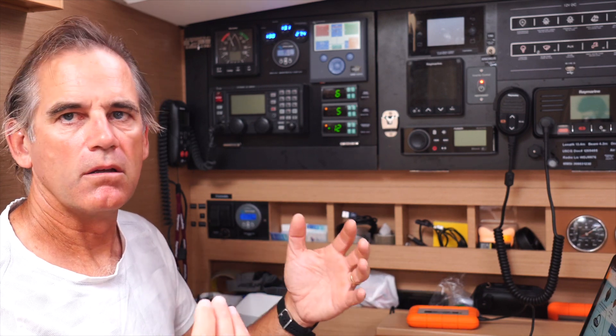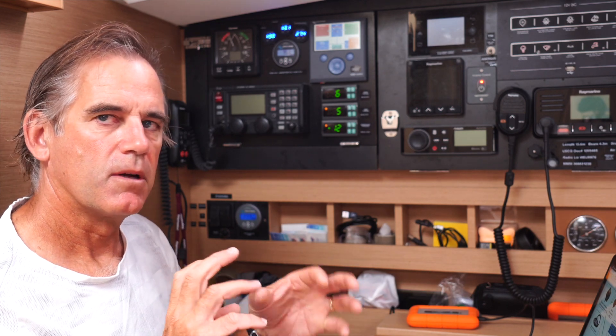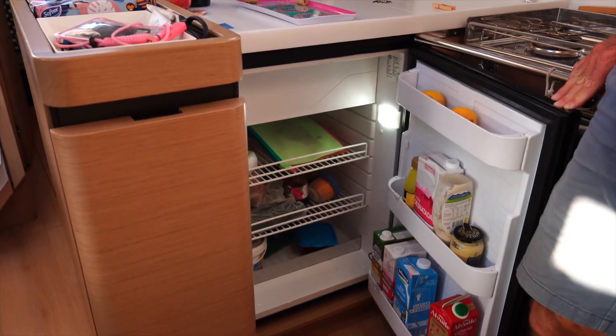it can tell you whether you're at 90% of your state of charge, or 80%, or 100%. It's also a valuable diagnostic tool. You can look and immediately know what's going on with your battery bank — am I drawing down 10 amps where I don't hear anything running or don't have anything turned on? You can also assess the draw of different devices. If you're drawing 10 amps and you turn a refrigerator on and it goes up to minus 15, then you know that refrigerator takes exactly 5 amps — which is all very valuable information.